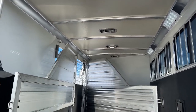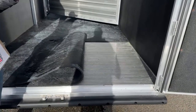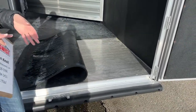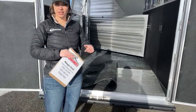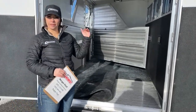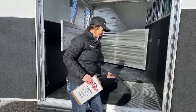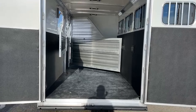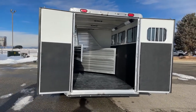On this one, we currently have just rubber mat floors over the aluminum floors — here's what the aluminum floors look like underneath. If you want to make sure the floors are not getting any urine down to them, we have a dealer just south of us that installs worm flooring. Worm flooring eliminates rubber mats and puts an impenetrable layer on the floor with a rubber composite on top, preventing any liquid from getting to that aluminum floor. The only thing that eats away at aluminum is horse urine, so keeping that floor clean is important. You've also got an LED load light up above so horses can see the outside a little easier when loading in the dark.